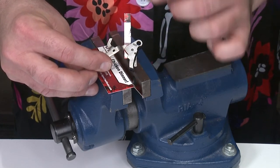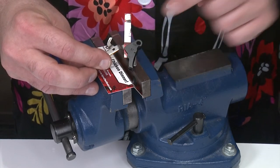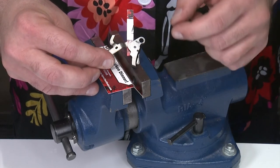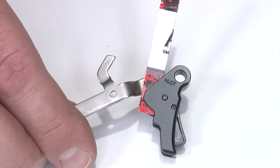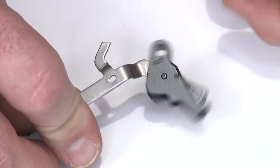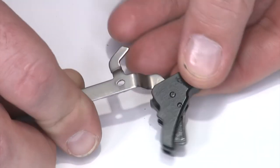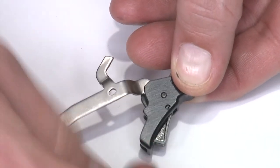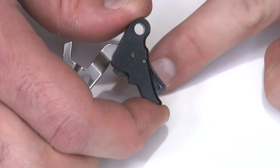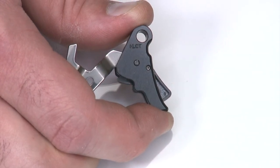Take your time, and whatever you do, don't put the trigger pivot pin through the trigger bar itself — if you misalign it, you can do some damage. Little turns at a time on the vise to get it just perfectly into position. Once I have the trigger and bar assembled, I'll remove the shim and you'll notice it freely falls around the pin — that's exactly what we're looking for. I'll also check the safety, flick it a little bit, and make sure it's popping in and out on its own to confirm we didn't crush the trigger body.